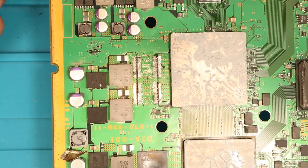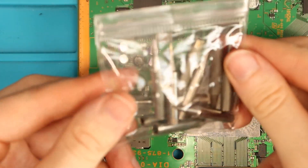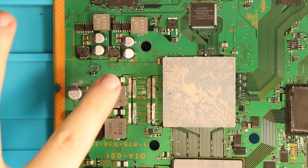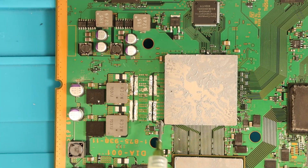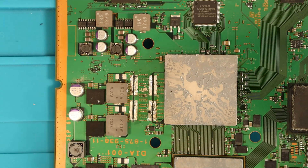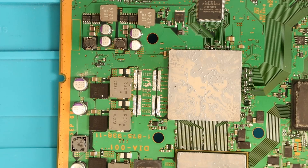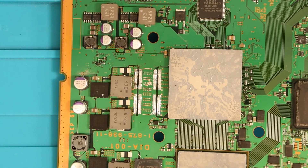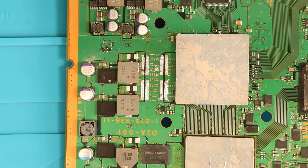Just removing all of the debris now — they look a little bit clearer than what they were. I'm going to change the tip on my soldering iron and use it to clean up these bits and get any little remains off. I'll put some more flux on, and then use some IPA for a quick cleanup. I think I've cleaned it as much as I can and done a good enough job. I'm just going to tin it up and get some extra solder on the pads.